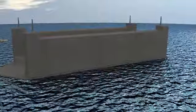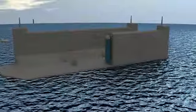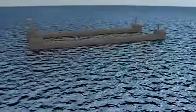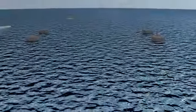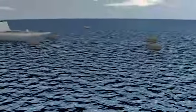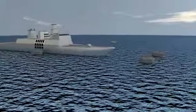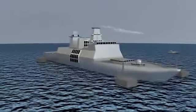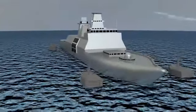The basic concept of this floating dry dock is that valves are opened, which allow the two side tanks to fill up with water. This extra weight of the water will cause the deck to sink below the water line, and it's a controlled operation so that only a predetermined volume of water is allowed into the tanks to reach a certain depth below the water line. This continual filling causes the deck to sink far enough for a ship to maneuver between the two outer tanks and over the flat deck.